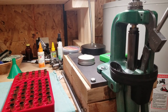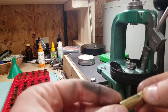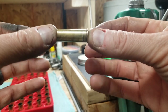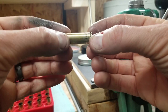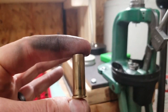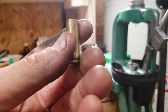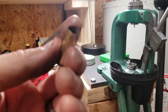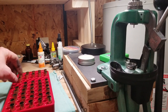I do put lube on these cases. You don't have to lube them because it is a carbide die set, but I do. This die does resize the brass, so I anneal the brass if you're going to work it at all — and we have to, since we expand it and then crimp it. So you work the neck at least twice. Even though it's straight wall, I anneal so I want it to last.